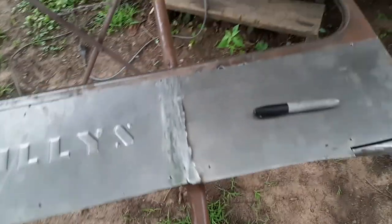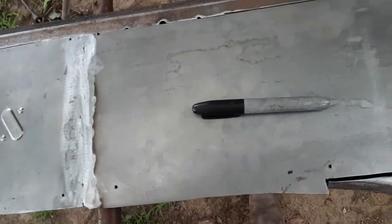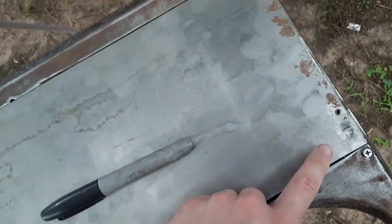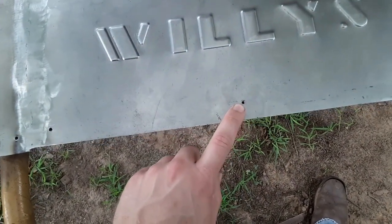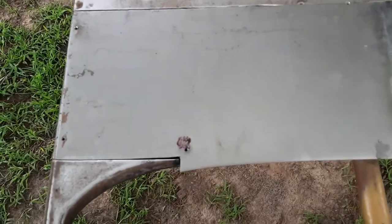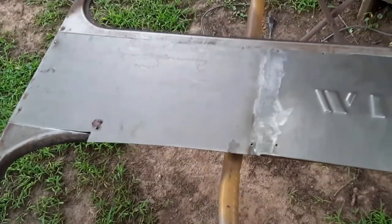Alright, I got my new patch made up here and I'm going to start laying out where I want my spot welds. It's not really a big deal where I put them, but I want one right there, right there, probably one there, probably one right there — on all four corners. These screw holes aren't going to do anything; you need at least quarter-inch holes to get good penetration. That's what I'm going to be doing.